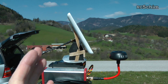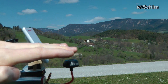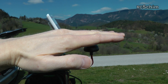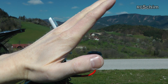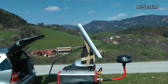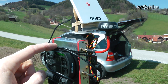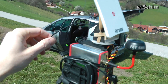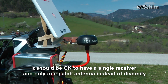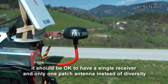Here I estimated an angle of around 20 degrees, because the opening angle is 35 degrees — giving you 17.5 degrees down and 17.5 degrees up. So it's a fixed angle. On this side I have an antenna connection cable; I had to use a longer cable to avoid tangling. I also have the skew planar wheel antenna here, which isn't in the optimal position, but it's just a second antenna as a backup.